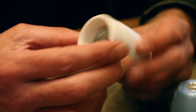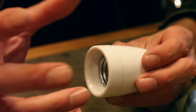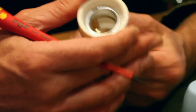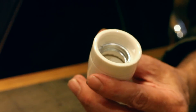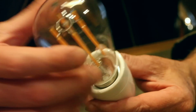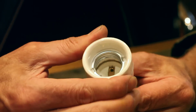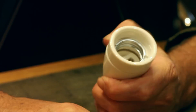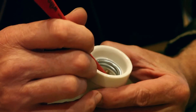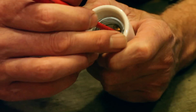The first thing to do is disassemble the lamp holder, which can be a bit tricky. We get a lot back that have been damaged by electricians not understanding how these work. All Edison screw lamp holders with a screw bulb need an anti-rotation feature so that when you unscrew a globe that's sometimes stuck, it won't undo the lamp holder and expose the cable. To disassemble for wiring, you need to find the little anti-rotation ratchet, which is hidden in here — push that down and twist with your other hand.